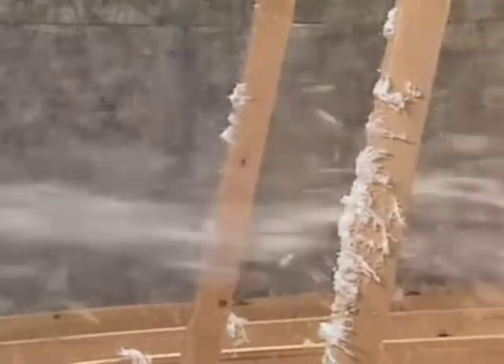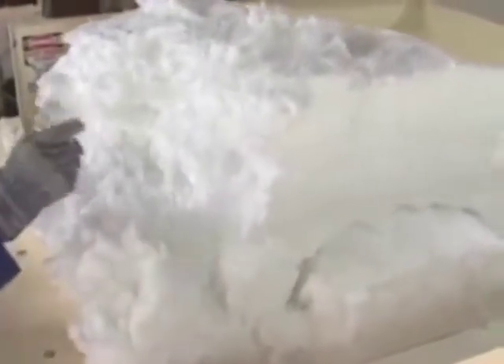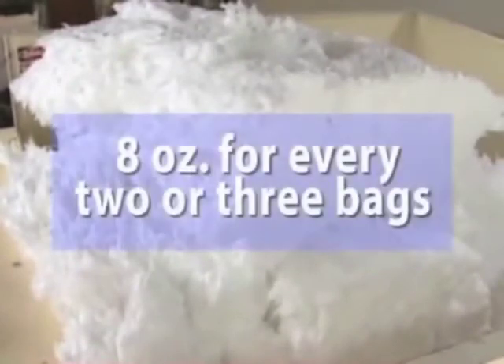You may also experience static electrical shocks as you work. You can reduce weather-related static by simply pouring water into the hopper, but it's important to add the right amount — too much water on dry days and you'll blow clumpy. The right way is to add about eight ounces of water to the hopper every two or three bags, but since no two days have the same weather, you should experiment each time to determine the right amount.